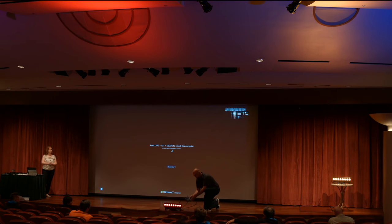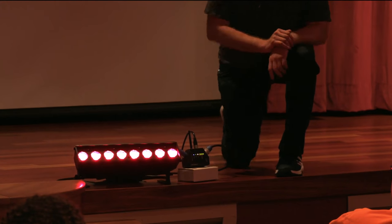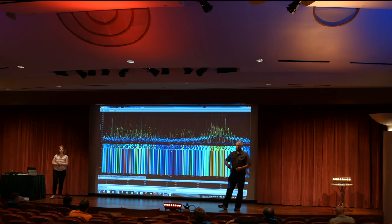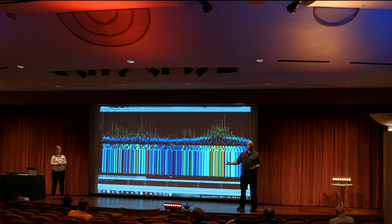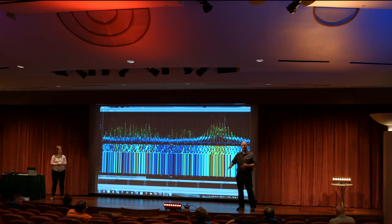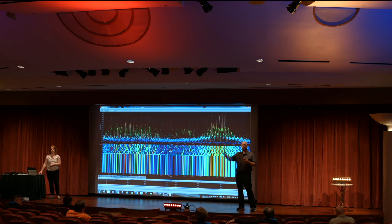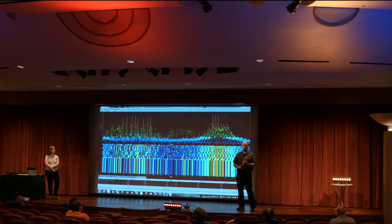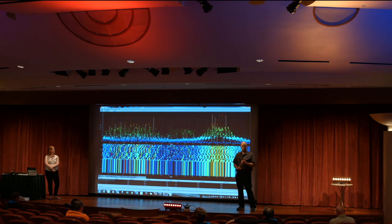Sure. So the relay, it is a 16 amp relay. As you can see here, there is a power in and a power out. This allows you, using the DMX control, to turn the power on and off to the fixture remotely. On a very simple application, for example, if you just shut down the console, after about 5 minutes or so, it will automatically power down. That way you're not keeping the lights or the electronics on and having that vampire load on all night when you're done using it. It just allows you to introduce controlled power where you don't have it already.